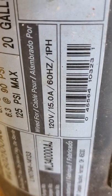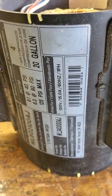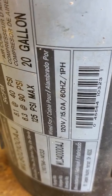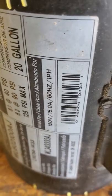If you look at the nameplate of this motor, it's 120 volts — that's what we use in the United States — and it's 15 amp. So this motor was made by the manufacturer to load up a single circuit. Typically we have 15-amp circuits in our homes; in my garage I do have some 20-amp circuits. For a 15-amp circuit, this is the biggest electric motor you can run without tripping the circuit breaker, which translates into the biggest air compressor you can have on 120 volts. This motor doesn't list horsepower or RPM, but we can look those up.